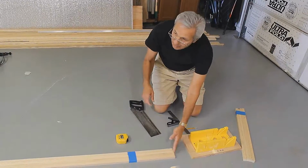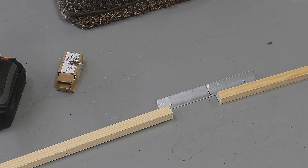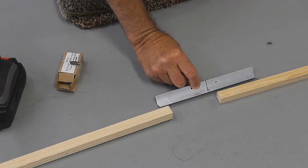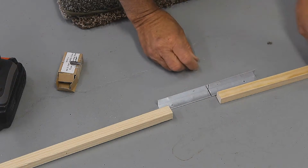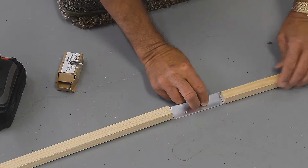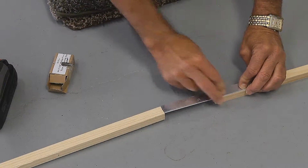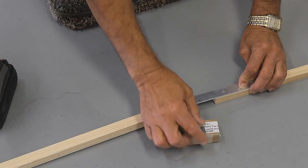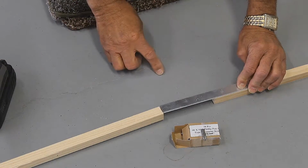Now we will assemble the 3-foot pieces to each one of these with our aluminum angle. Take your 4 9-foot pieces and your 4 3-foot pieces, put them together so that you have 4 12-foot pieces. To do that, we're going to use a 90-degree aluminum angle. There's a black mark here, that's the center of it. If you take the 3-foot piece and put it exactly on that black mark, the holes are already in the aluminum. So in the kit, you have a bit that comes with it, and these are the number 6 5/8 that you'll be using in there.